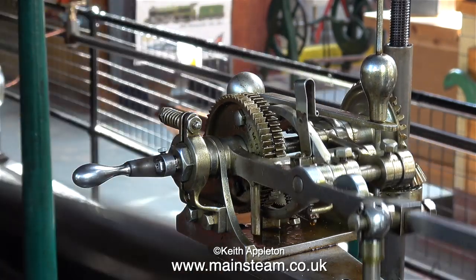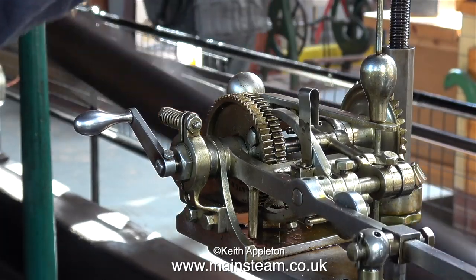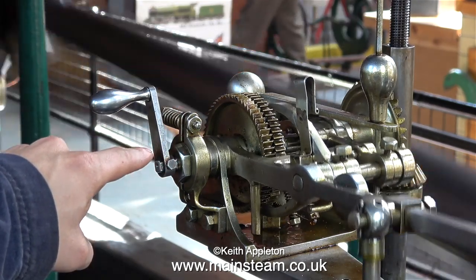An escapement consisting of two catches is driven up and down by the reciprocating motion of the engine. A control rod, which is also hooked to the governor in parallel with the main control rod, can bring this escapement into engagement with either one ratchet wheel, the other ratchet wheel, or neither.